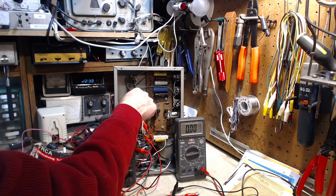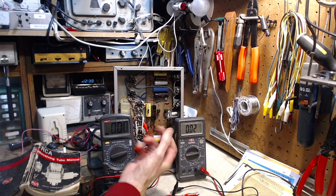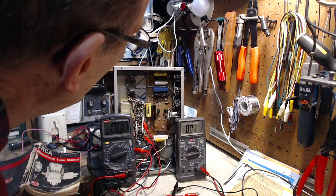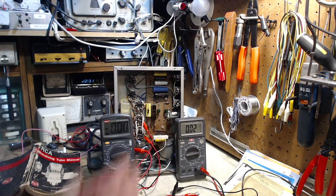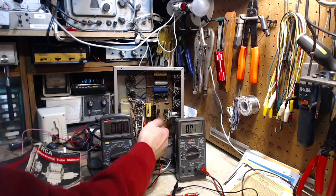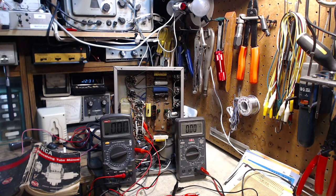I can see how they've done it though. These wires come along and then they're pulled through a brass ring — a copper ring. And I can see the stranded wire. It's been pulled up tight, so underneath the board there is no... You know what? That's a sandwich — there's a board below the board. So these wires are sandwiched between two boards, meaning there's no way they can short to the chassis. I've been wondering about that the whole time I've been looking at this. I guess another possibility is the huge heat that developed down here — maybe it's done something underneath the board I can't see. Some wire insulation has melted off. A short circuit has occurred under that board.